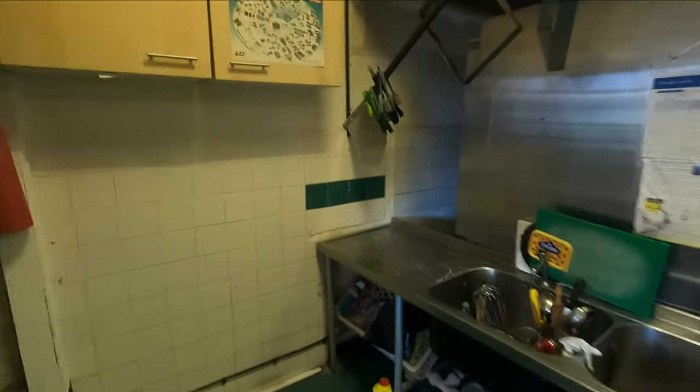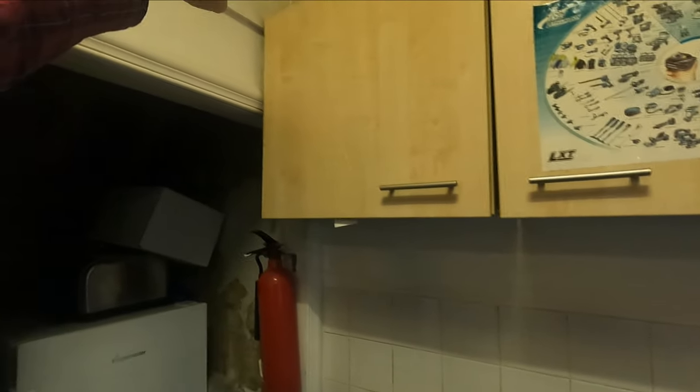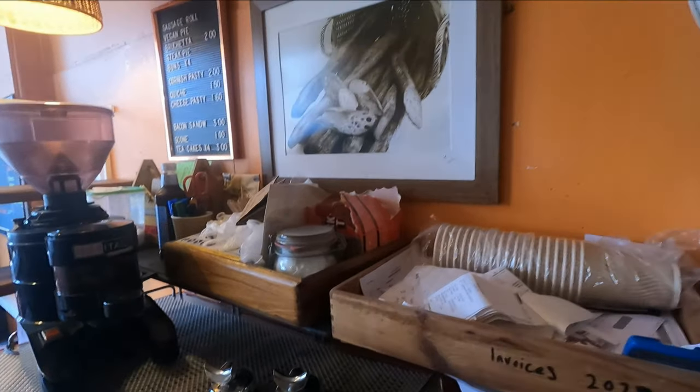The nearest water pipes are over here behind the oven, so we're going to take a supply up this wall, over the top of that cupboard, along there, onto there, through there, and then along the top of the wall here and down. Out of all the trades, plumbing is probably the one where you can save yourself the most, quite easily. Most plumbers these days just use push-fit connections — plastic pipes pushed into plastic connectors. There's not even any brazing involved, so pretty straightforward. Let's get on.